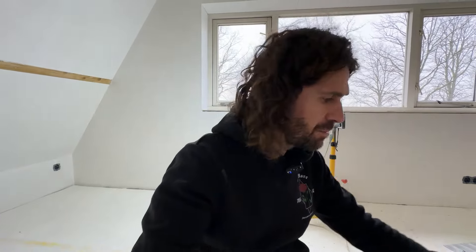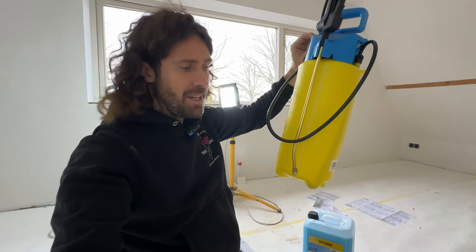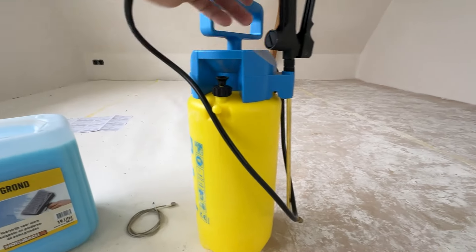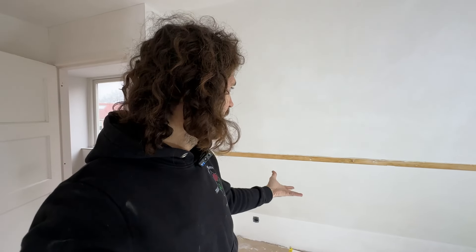I'm going to get back upstairs today. I'm doing something very tricky that I've never done before painting — it's a tip from Henny. If it doesn't work, Henny, this is on your head. But let's see if we can get this trick to work because it could save us a few days. So here's the genius or crazy idea from Henny: to save time you buy one of these, which is like a garden hose with a spraying spout on it, and then you buy a primer. You pour the primer into here and then spray it on the walls very lightly so that it doesn't run, and that seals the plaster so that you don't have to do the primer separately. It's much, much faster — instead of taking probably at least two days to do a coat of paint, this will take about three hours to do this room and the attic. So I'm going to try it here first, which is the cupboard, because this is going to get built in. So it doesn't really matter if I mess this up.